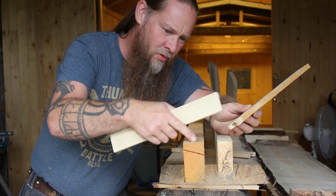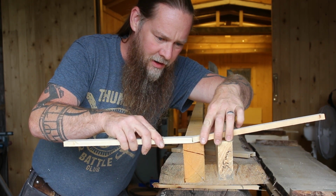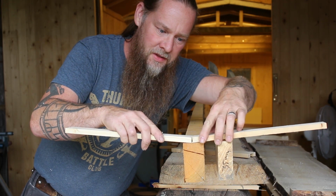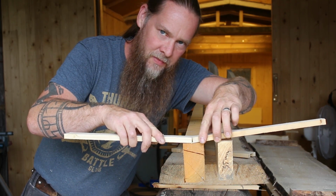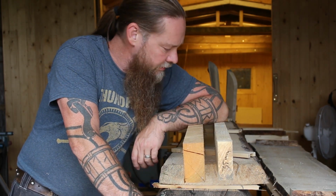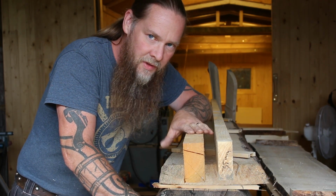But if I swap it to a 45, that's 2 inches, I believe, I get a lot more support. I don't expect the bed to move as much as needed for the slats to come off the edge of the beam, but this gives me a little bit more of a margin and also quite a lot more strength in the middle support beam. So I will use this instead. I just have to make it a little straighter first. It's not that great right now, but that's an easy fix. So I'll use this, save this for something else.